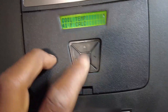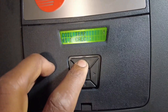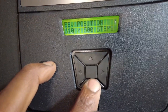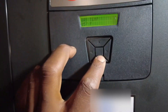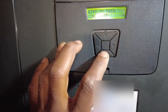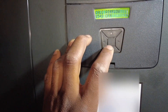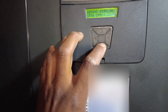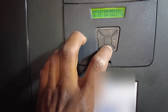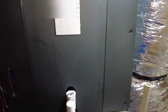Now my coil temperature is 41 degrees, superheat is 16 degrees. The EEV opened up a little bit more — I love this machine. Constant airflow: now reading 1536, now 1549.